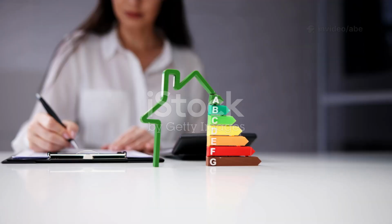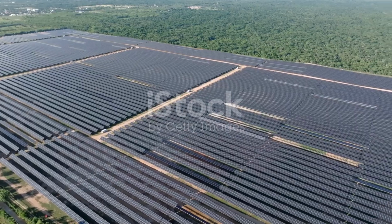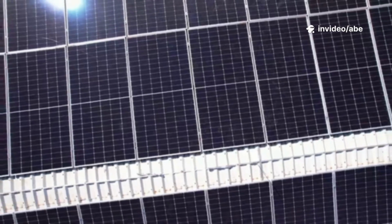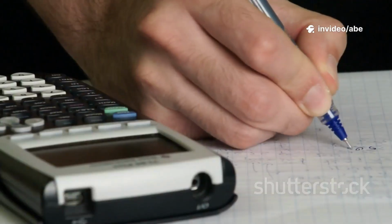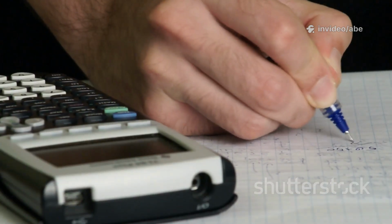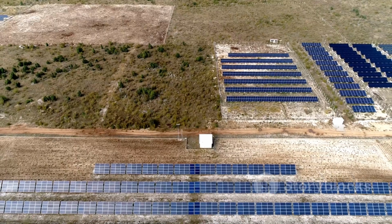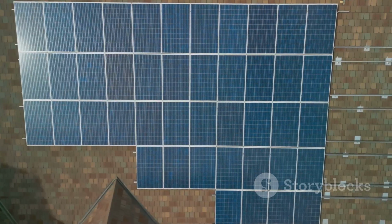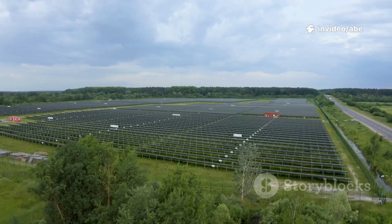Let's see how. With your daily energy need in hand, sizing your system is straightforward. Divide your daily watt hours by your location's average peak sun hours to get the minimum solar panel wattage. For 888 watt hours and 4 sun hours, you need at least 222 watts of panels, but oversized to 300-400 watts for reliability. More panel wattage means faster charging and better performance on cloudy days.